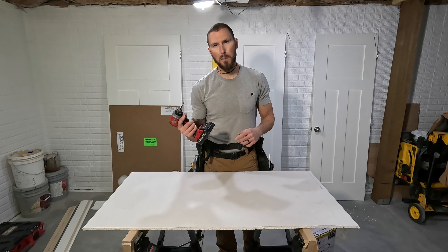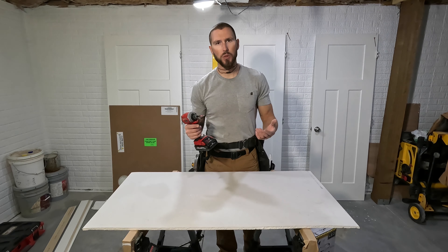Number three will be an impact driver. You can screw all your framing together if you don't want to buy a nail gun. With that efficiency in mind, if you are going to use an impact and screw all your framing members together, I recommend using structural screws. We like GRK number 10s for framing and have had great luck with those.